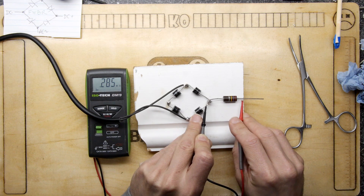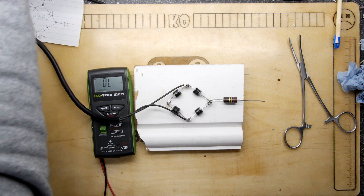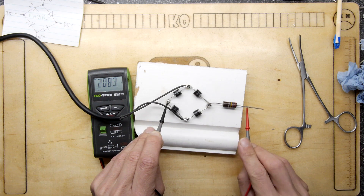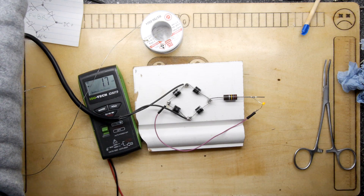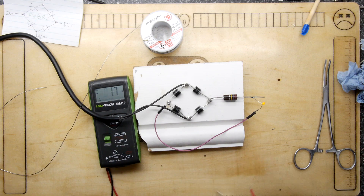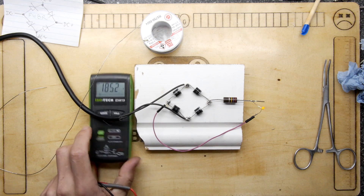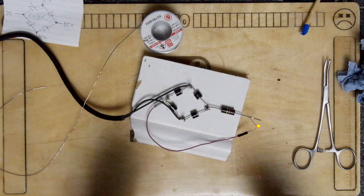I don't even know the value of that resistor, but this is how we learn things — or learn nothing. That resistor is 0.28 megaohms — doesn't that sound great. We're going to put ourselves back in the voltage range, back into DC, and plug back in. I've hooked up an LED — let's plug that in and see what happens, covering my face. The LED glows — one of those yellowy LEDs, sort of a weird colour. It's going pretty steady. Measuring the voltage: 1.8 volts. A pretty elaborate way of illuminating an LED but it does work.